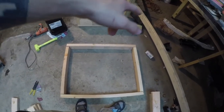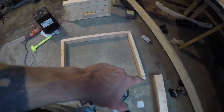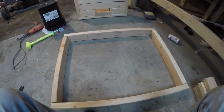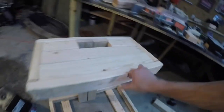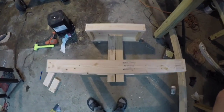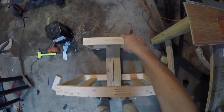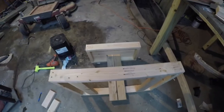What I've done now is taken these four pieces — they're the second biggest of all of them. We're going to screw those in as the base of the floor, then take these 24-inch boards and put them as the floor surface itself. I've got all this put together and attached. Looking at it from the bottom up, your feet would be right here, 16 inches in between on each side, and the top goes up there.